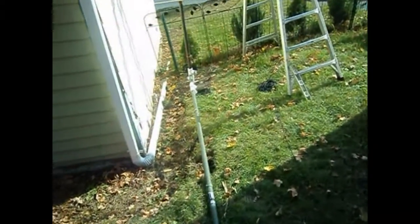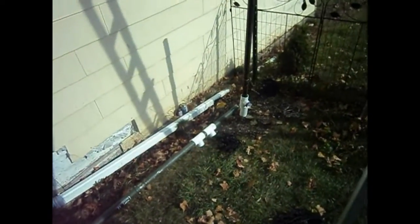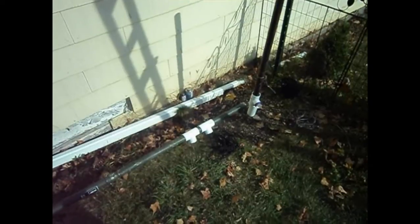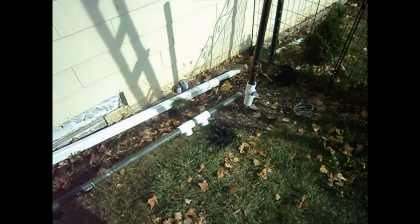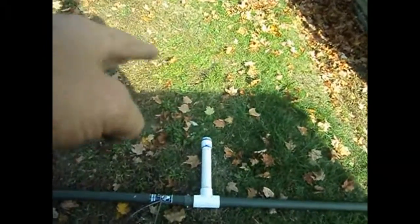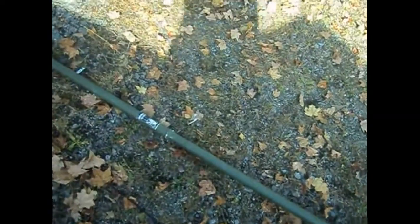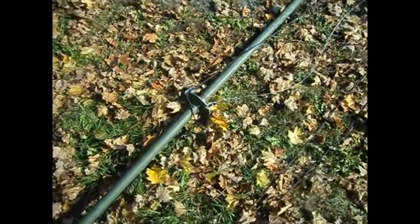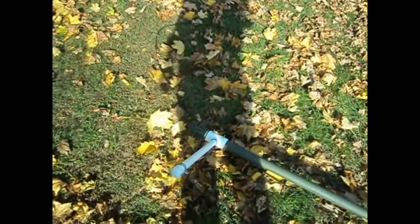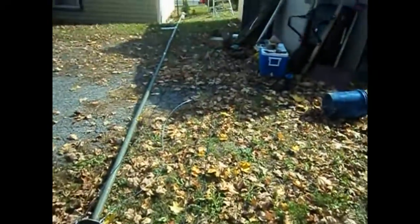Hey YouTube, it's been a couple hours of work at least. I'm about ready to do the erection of the antenna to the standing position, and I have to get my children to help me — they're teenagers. Here's the setup: PVC fittings that are going to be glued together to hold the poles to each other. Up to here we have an offset PVC fitting which is going to attach to the edge of the roofline, and there's going to be a flange on the other end that screws to the roofline. Each one of these joints are screwed together with a stainless steel screw and nut through the reinforced collar. Up to the ring that holds the anchors: three anchors — two rope, one galvanized wire. Then up to the top with our pulley and the pulley rope, which goes down and is tied together so I don't lose it when it goes up.